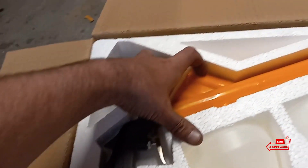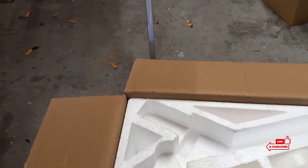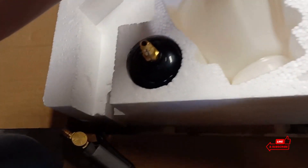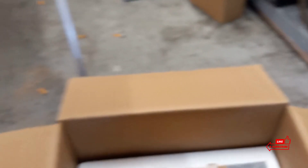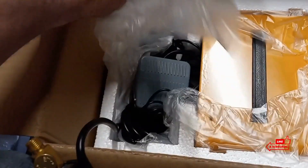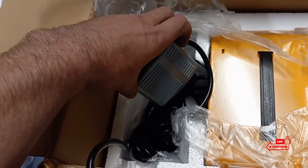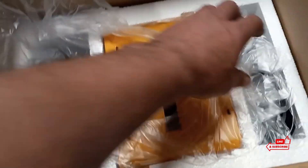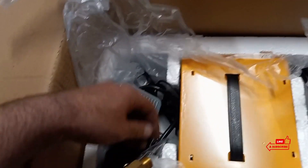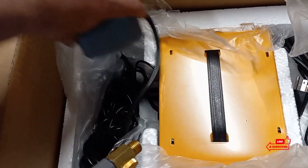There's another tip for the end of the gun. We got the pedal to activate the charge — that's usually how powder coat works. I believe the powder is positively charged and then there's a clip that goes onto whatever part you're powder coating — it negatively charges the part. That's what makes the powder stick to it. And then obviously you bake it and it melts, or flows, whatever you want to call it. Here's the gator clip.